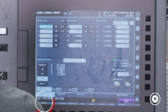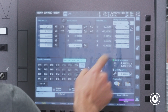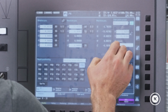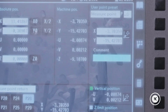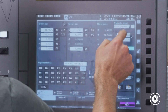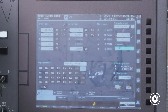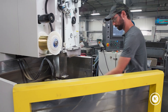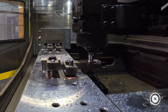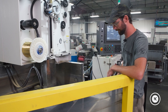We're gonna go to position and save it as measure point 28 — there's nothing in there so we'll go to measure point 28. It stores my XY coordinates and I'll comment it 'setup 1.' Always name your work locations, because if it's not named I'm gonna overwrite it when I come along. We stored our XY but did not store Z. So now I'm gonna go to jog, come down and set my Z because we're pretty far away. I'll just eyeball it — we'll call that good for our Z height.